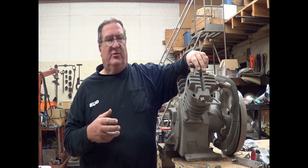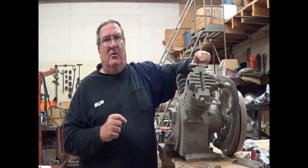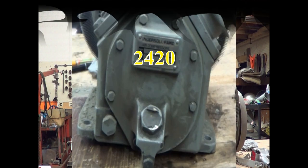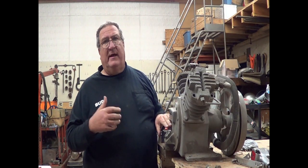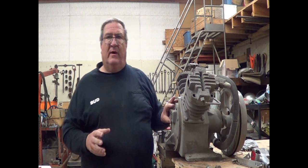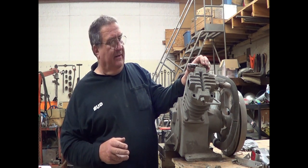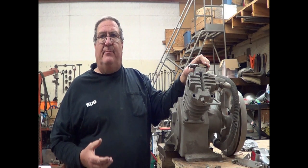The fingers in the 24-2 were replaced with these kind of valve parts. The other big difference from the 24-2 to the 24-20, aside from the change in the valves and the valve cover, is that if you have a 24-2 you'll notice there is no unloader valve here. When they went to the 24-20 with the head redesign, they eliminated it — I'm sure to cut cost — but it was also a trouble spot, with the unloader valve and the governor weights sometimes failing. And they decided to unload to this T right here, running the unloader from there to a pressure switch between the motor and the pump, using an unloader-type pressure switch.